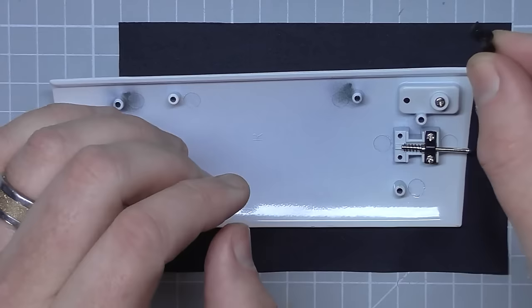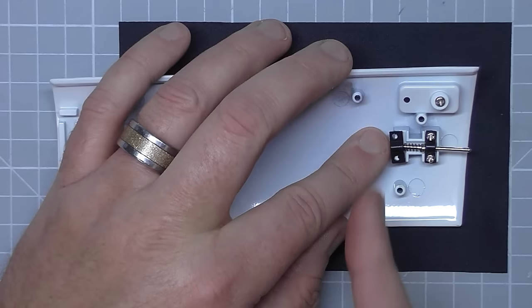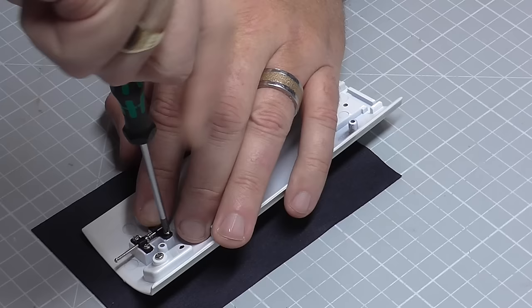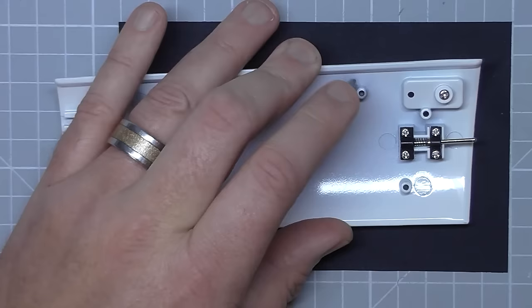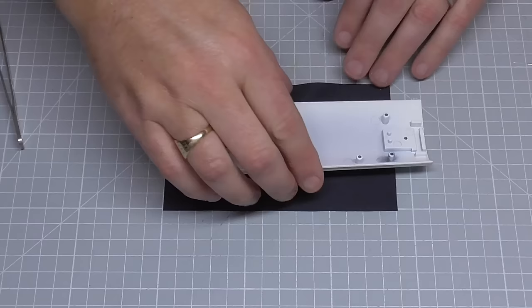And then I'm holding that in with the other bracket going onto the other side. The screws are actually towards one edge, so they're going to be towards the closest edge on this side here. Again, it's DS23 screws. I am going to need to compress it just a bit like that. And then get this in. You do want to make sure that when you put this bracket in, you don't trap any of the spring underneath this, because you want the full tension of the spring between this section so that it can have that springiness like that. All that's left to do then is just to move that slightly down there.